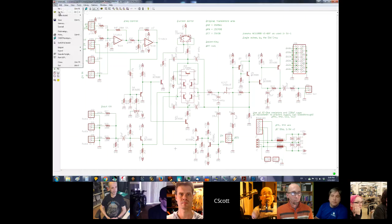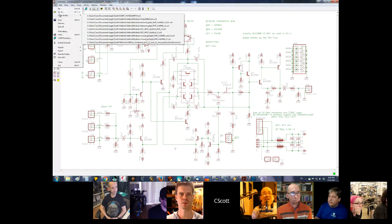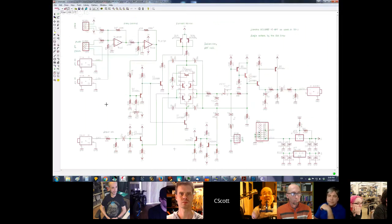Okay, I went to make a Eurorack version, which oddly enough looks very similar. That's the schematic. And let me pop out real quick here to show you. This is the little 4 HP Eurorack version. Same thing, just a different shape. Okay. It doesn't work. And I spent several days going, same circuit, same topology, same parts. I built one specifically exactly like my original one from 2004. Didn't work until I hit upon the idea that there is, in this particular transistor array, this transistor at the top here. Let me put me back on the schematic so you can see what I'm pointing at.